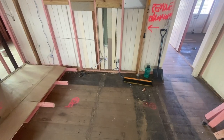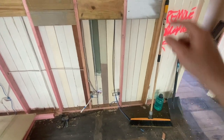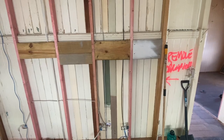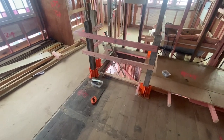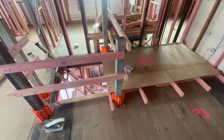So similar to the other rooms, we have all the wiring hanging down in the ceiling for the LED lights going in, as well as the smoke detectors. On the wall behind me, we've got noggings put in just for a TV to be wall mounted. Unlike some of the other rooms, because they don't have wiring for TVs, this one has run an aerial cable as well as a data point to service the TV going here. What we've also done in this week's gap is cut out the opening for the staircase going in. This should come in about 2 weeks' time.